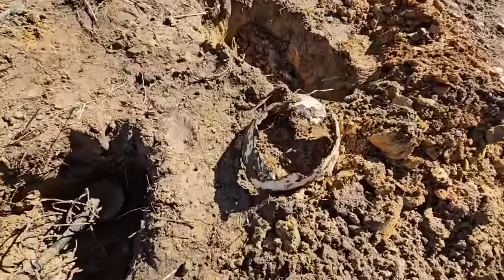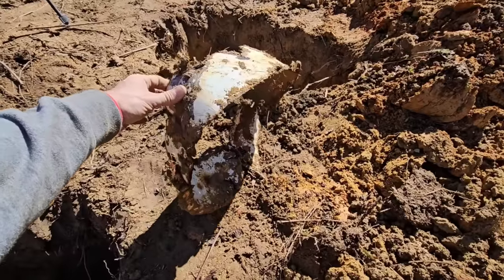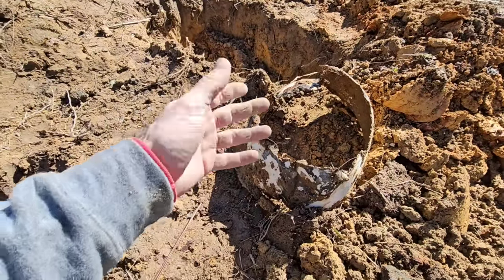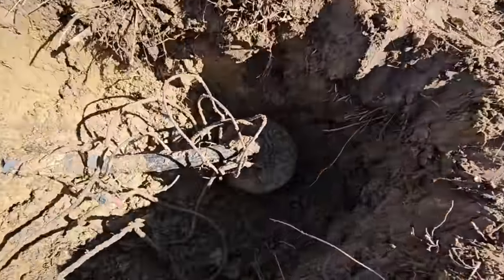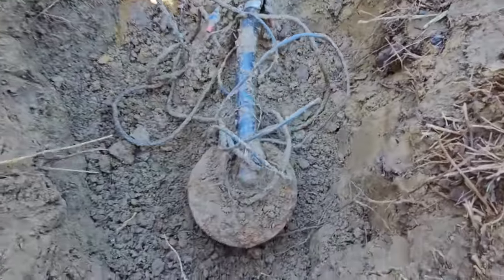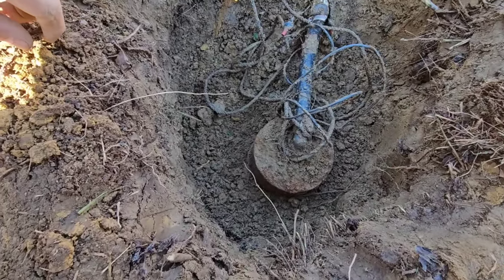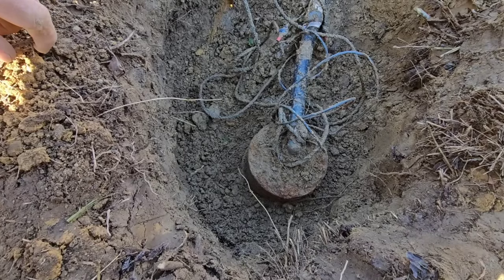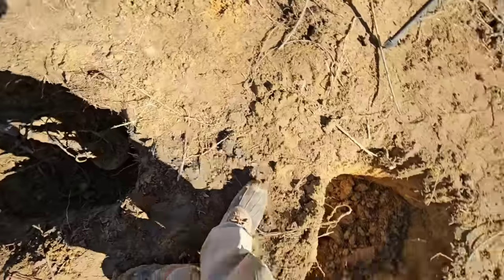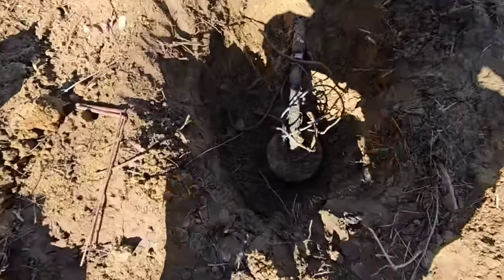This was the metal cover ring wrapped around the well — looks kind of like an old pot with the bottom cut off. Here's the well. It's only buried about 12 to 14 inches below grade. Where I originally thought the well was, I was only four feet from it. That's just how frustrating finding a well can be — you can sit there and dig and dig with no luck. That's why I decided to start towards the beginning, figure out the depth of the wire and pipe, and use that as a reference for how deep it should be out here.